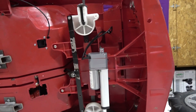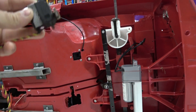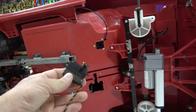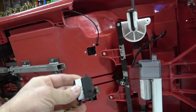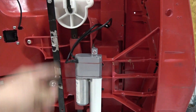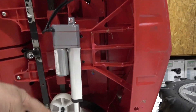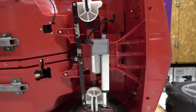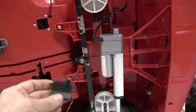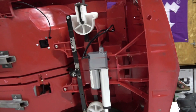I got good feedback in the comments from people asking why I didn't use a big servo. The main reason is difficulty mounting and price — they're three to five hundred dollars for a big servo. You'd also need linkage like in an RC car, which is way more work. A linear actuator is literally just an electric push rod — super simple and cheaper.